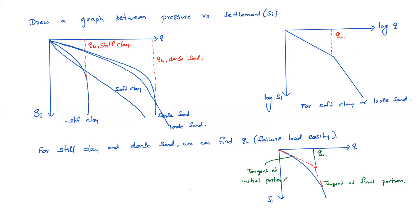After conducting the test, by applying load gradually with the hydraulic jack and observing settlement, you plot how settlement responds to each load increment. From this, you calculate the ultimate load. The next step is to find the ultimate bearing capacity of the proposed foundation.